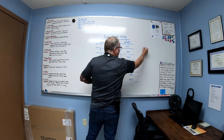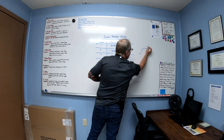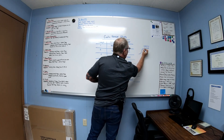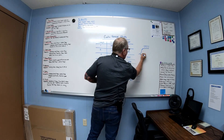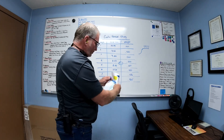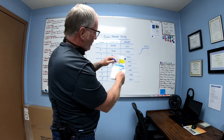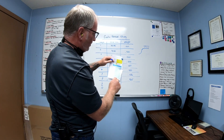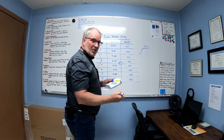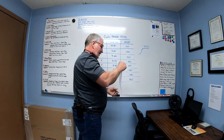You're trying to plot it so that you can see: I started off up here at 10 seconds, then all of a sudden the curve went down. So this here at 10 seconds, 9.5 seconds, 9 seconds, 8.5 seconds — you can see the trend starting to fade off and go down. This is where your part starts losing weight. You can plot it with sample one through fifteen on one axis and hold time on the other — going from the highest hold time down, either in one-second or half-second increments, depending on your part weight and part size.